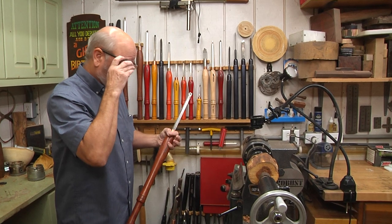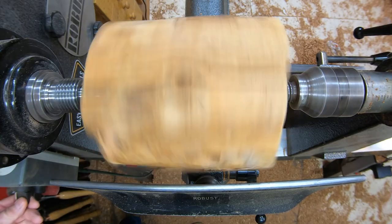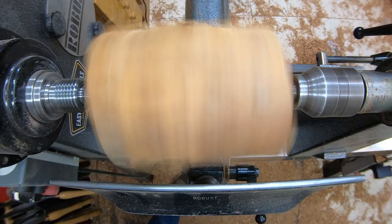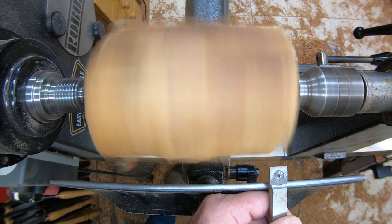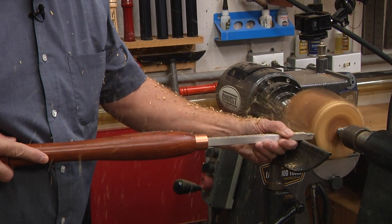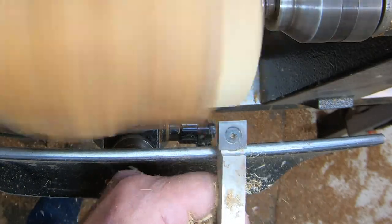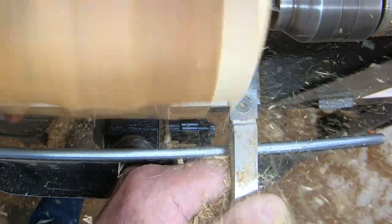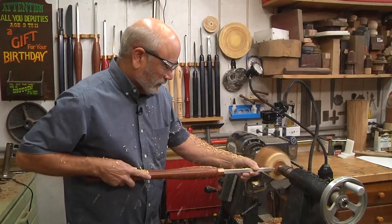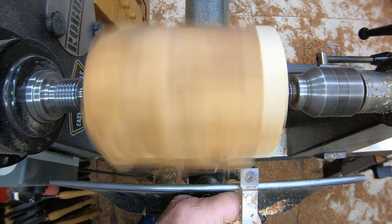I'm going to take a square carbide and just do some roughing out. This is the top, this is the bottom. I've already turned it by hand — nothing's hitting. Speed is low, let's go a little faster. Stand off to the side; if anything flies out, I don't want to be in the way. We're just going to gently nibble this away. We don't want to take a lot of wood at once — if you're too aggressive, you can pop the wood off. This is cedar, by the way — Oklahoma's fire starter. So when people were suggesting burning it, they weren't kidding. These things blow up in a heartbeat. But it is cutting beautifully. This wood has been dried for 10 years at least. Can you smell that, Brian? That cedar smell you want to put inside your sock drawers — that's what makes turning cedar fun.